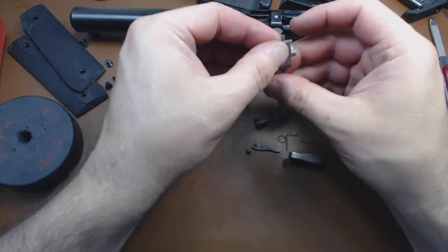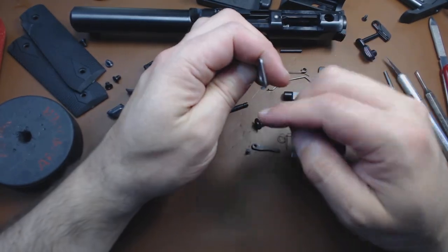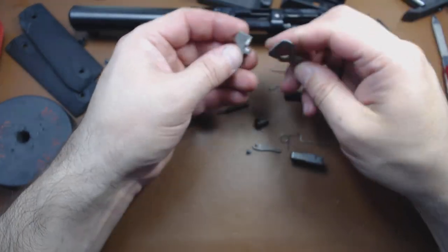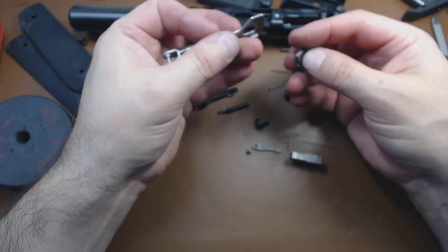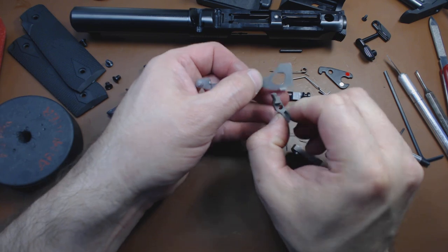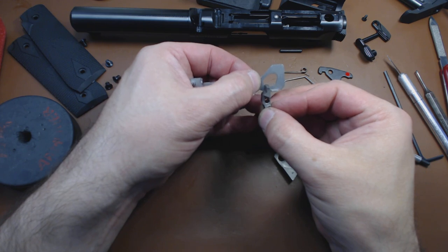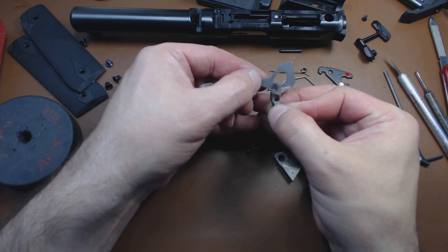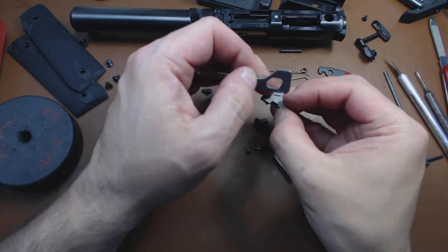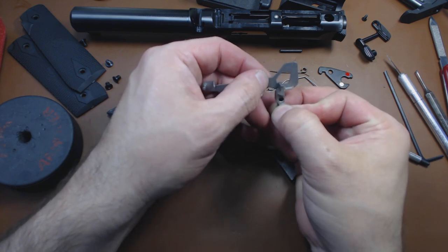the trigger is, if you can see that, this little area here, again, just a piece of sheet metal that's bent and punched 90 degrees towards the inside. So let's hold it the right way for the gun. So if the sear is sitting like this and we're pulling the trigger, try and get the angle a little closer to reality, you're going to pull the trigger like that. The trigger bar bumps in and pulls forward on this ledge, and so that's pulling the trigger. It just brings the sear away.